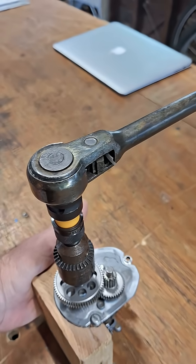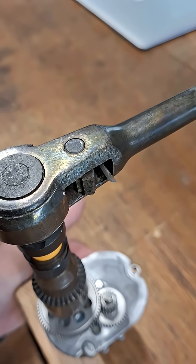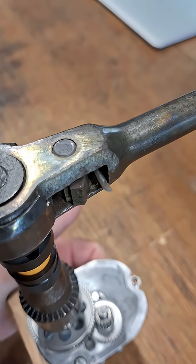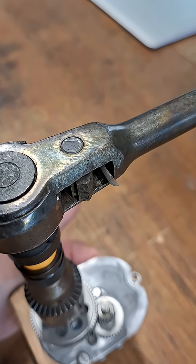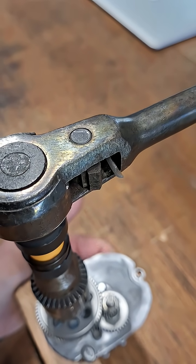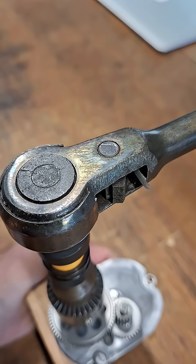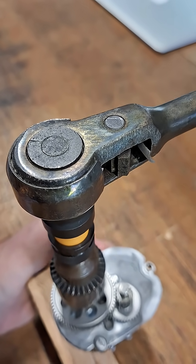Nice, so 10 grams — and it will calculate the back drag. This was really corroded and the spring didn't have enough tension to keep the mechanism going, so I had to put this little piece of plastic to compress the spring just a little bit and it got it working. That's going to be like the minimum amount of spring tension on the pawl to make this thing go. We'll see what reading we get — thanks for checking it out you guys.